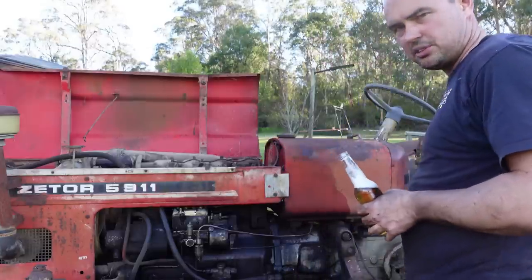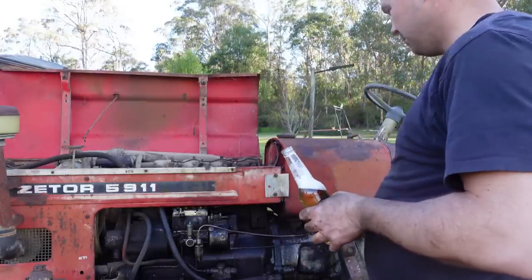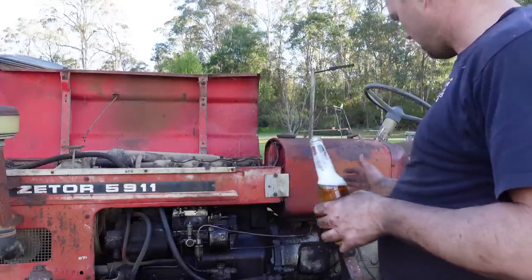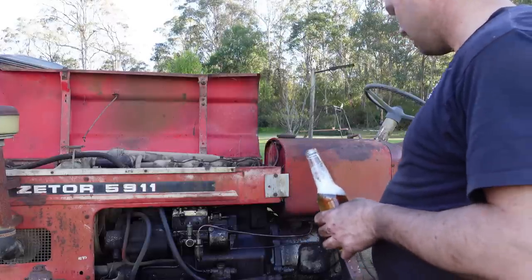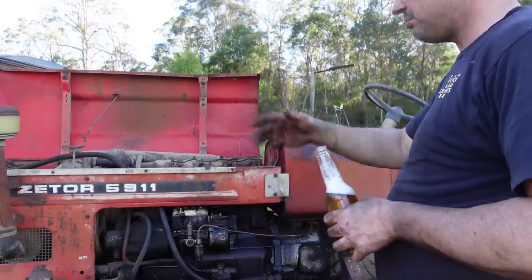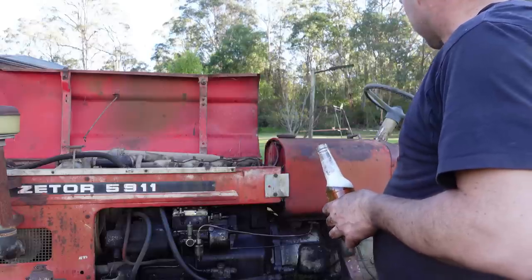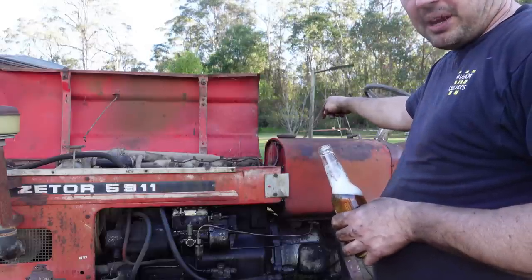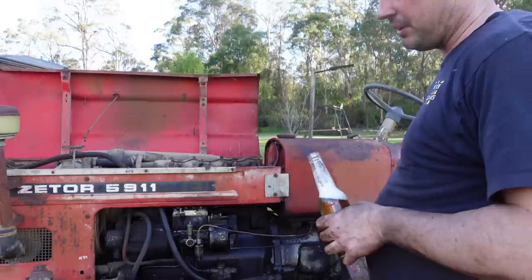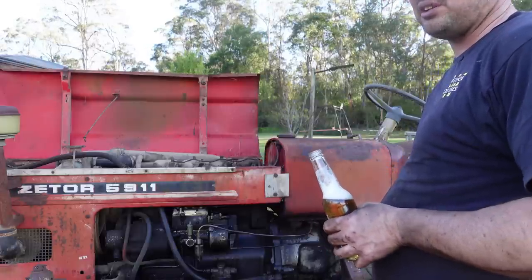I've checked everything over. Like he said, he's changed all the oils, the engine all looks clean, transmission all looks clean, power steering oil didn't get any water in it because it's sealed. Got brake fluid, I've got the brakes connected back up there, hydraulic brakes on these. Hopefully it'll bleed itself up going down there. The other one generally does. It runs out sitting there and you top her up.